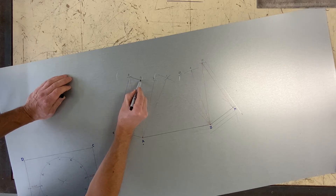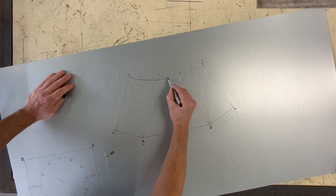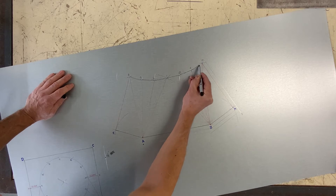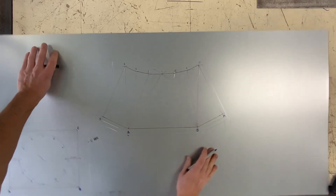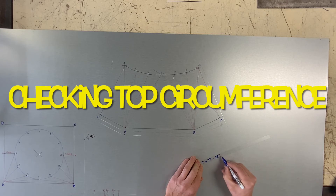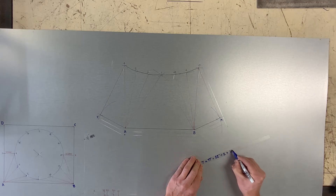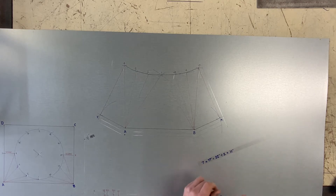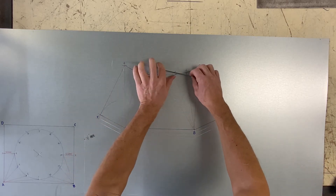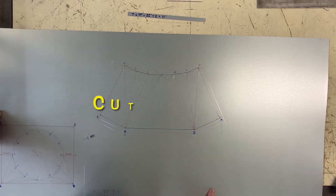Connect your numbers on the top to create the arc. It's always good practice before cutting your pattern to check the arc length on top. In this case we have a 7 inch diameter, which is 22 inches in circumference. Therefore I cut an 11 inch long piece and used it as a tape measure check.